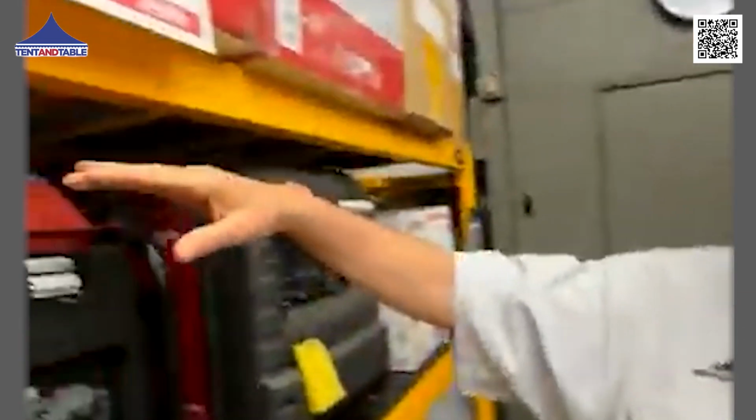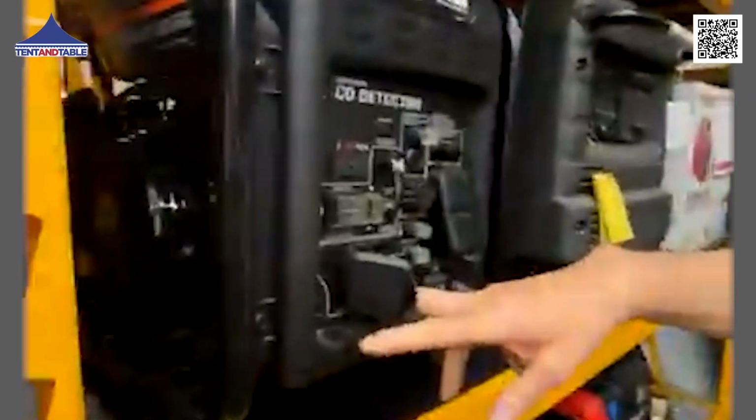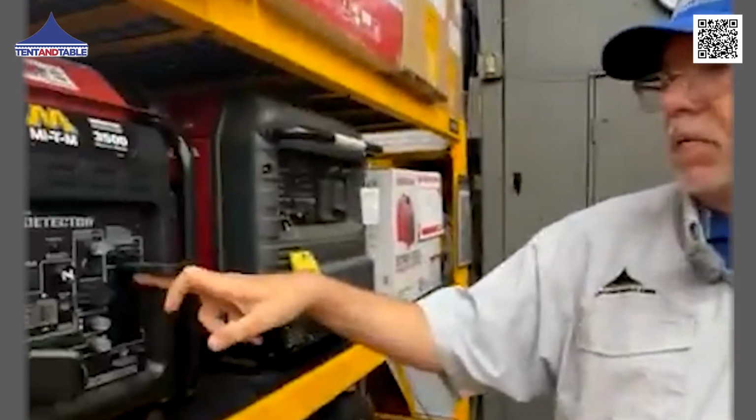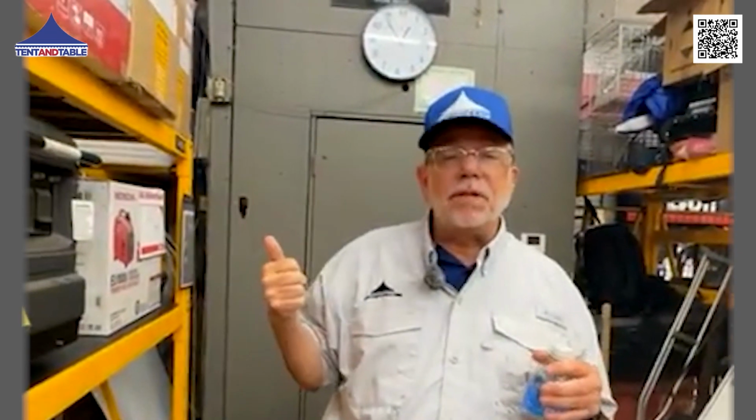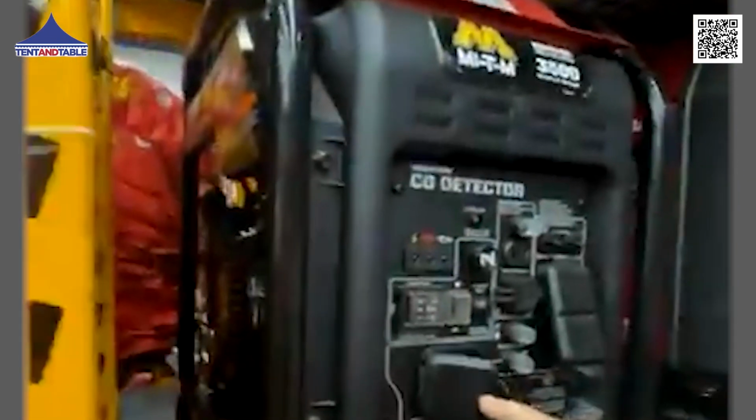When you're starting any type of induction motor or any motor, you're going to have a momentary power surge. So if I was running two blowers off of this inverter, I would have my twist lock NEMA coming down to one outlet. I would plug one blower into here, one blower into this. I would get my blower up to speed, get that unit inflated. Once it's inflated, you're going to be running on a lower amperage because you have back pressure. Then I would power on the second.